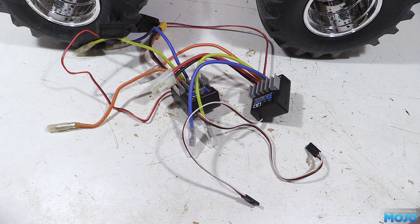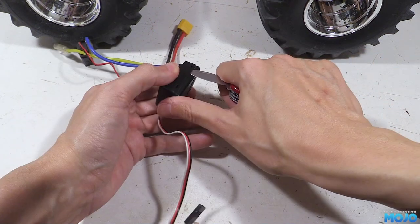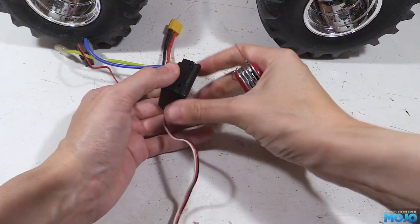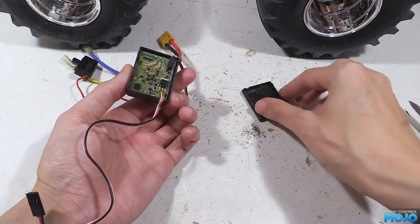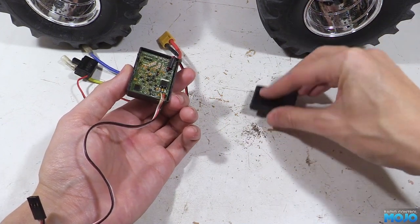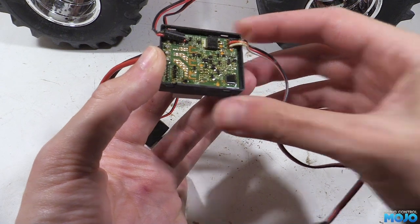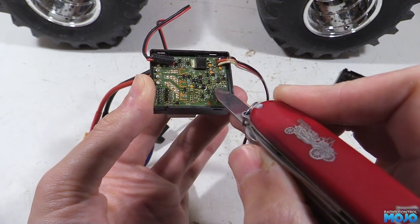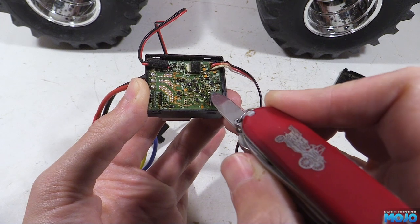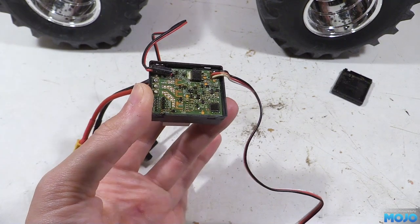A lot of ESCs have settings for the cutoff, but not Tamiya. Thankfully, Tamiya used a really simple voltage divider in the ESC for monitoring the voltage — it's just two resistors. If we open up the ESC, which is just clipped together so careful use of a knife to pop the clips off is all you need to do, we can see the back of the PCB and the bits we need to fiddle with. While very small, so not for the absolute beginner, it'll still be a fun project if you're up for a bit of a challenge. I'm not going to detail this mod here as LaneboysRC has a great article and video already, so I'll link to that in the description. In essence, all that needs to happen is we add an extra resistor between the centre of the divider and a ground point.